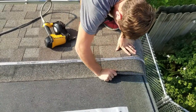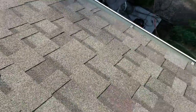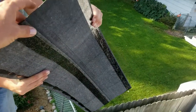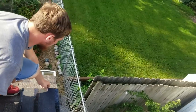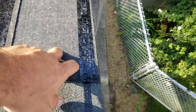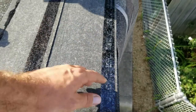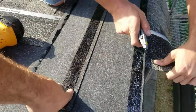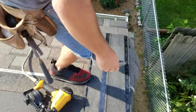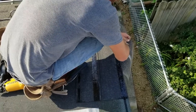Get that nice and flush. There you go — now you need one to cut with. See if you know the trick. This way — upside down — because you don't want tar marks on the shingles. If you go stepping on that you'll get tar marks. Leave yourself a little more than that — see how tight he put it? Leave yourself not quite that much, about right there. Now you got to cut it. Since you're doing this right-handed, start with the top shingle and go from that way — that's going to be the easy way to do it right-handed.